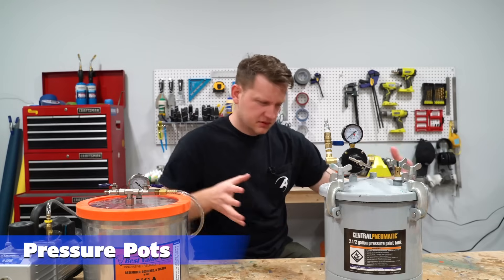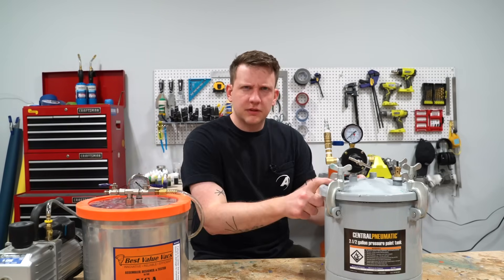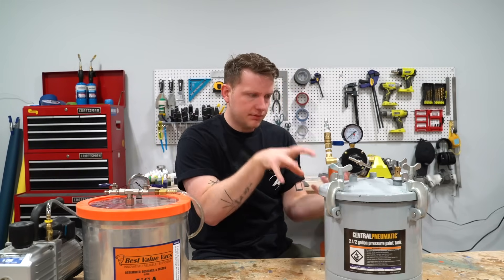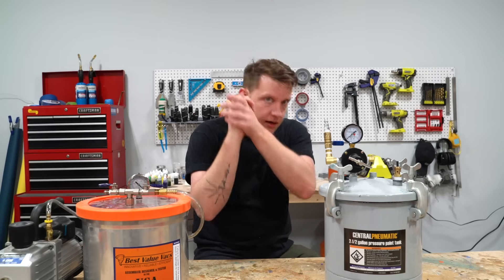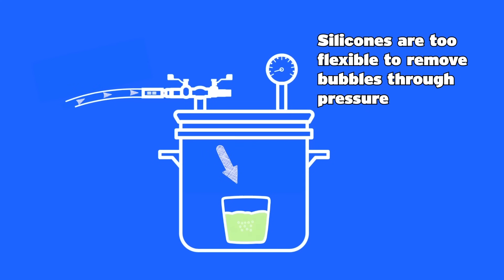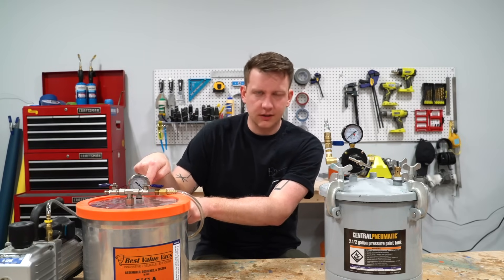Now the pressure pot. This adds air, compresses everything that's in there, and shrinks all the air to something that's actually impossible to see with the naked human eye. We want to do that for rigid resins — things that have a short open time where you want that clear, beautiful glass-like finished part, but you don't have time to get all the air out slowly. All that compressed air and intense pressure shrinks those air bubbles. The rigid resin fires off, becomes hard, and they're never coming back — it's locked in. If you put silicone in a pressure pot, that rubber's going to shrink and the air will go away, but the minute you open it back up and atmospheric pressure returns to normal, that air bubble may come back because the rubber is flexible. That's why we want all the air completely out with the vacuum chamber instead of trying to crunch it down with the pressure pot.